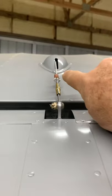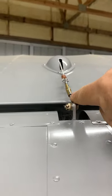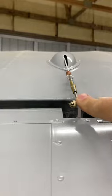Showing you the top — when we put that top bracket in, we lined it up. Here your cable is going to come back through here, come back down through here, and then back onto the aileron attach cable there.